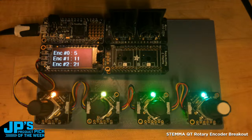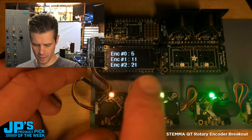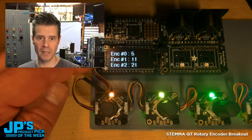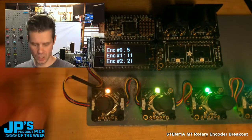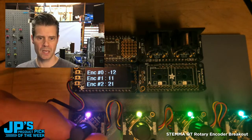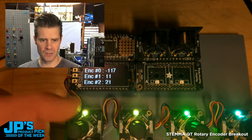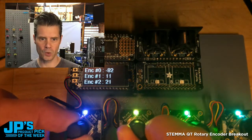There you can see three of them. I've taken a Feather M4 Express on one of these Feather quadruplers — a Feather Breakout — so we can add a few different things. I'm using the Feather and an OLED display wing. That OLED display wing has a convenient StemmaQT plug, and I've plugged it into one, two, three, and four of our rotary encoder breakouts. You can see we're getting an update on encoder values for three of them. As I turn that, not only am I adjusting those values, but I'm also adjusting the NeoPixel color. They'll also work at the same time.